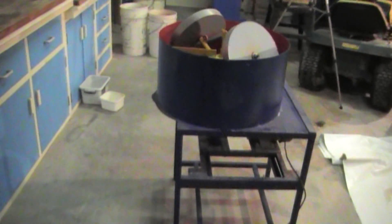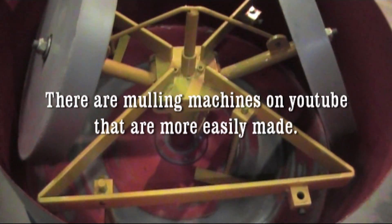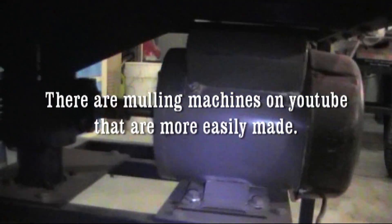On the other hand, I think I'll be mixing something in the vicinity of 200 to 300 kilos and I have a lot to cast — in the region of 1,000 kilos of aluminium is what I'll be pouring. So I'll need a fair bit, and because of that I've decided to build a mulling machine. This is the mulling machine — it's a very simple thing to make. Basically you've got mixing blades and then you've got round wheels which are quite heavy, and they're actually what mulls it.